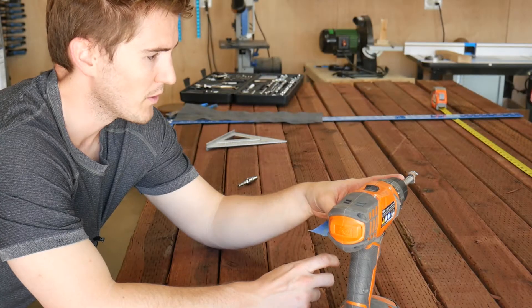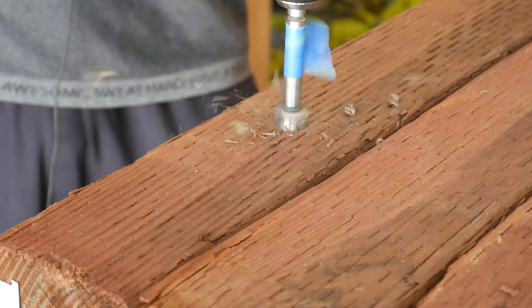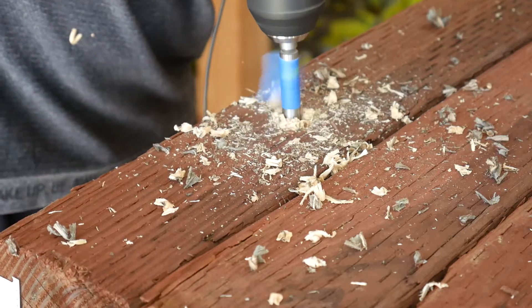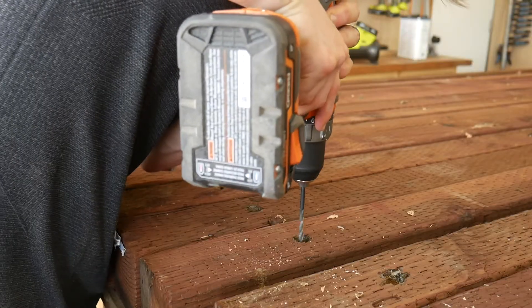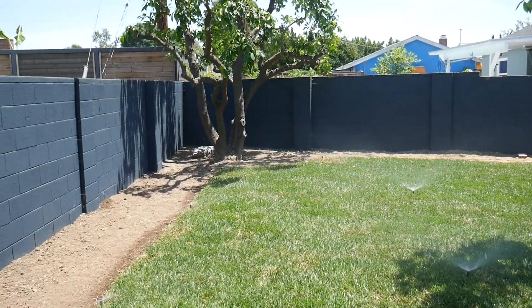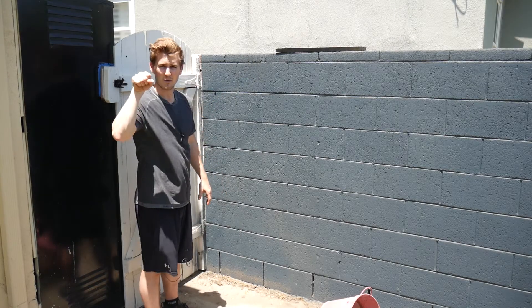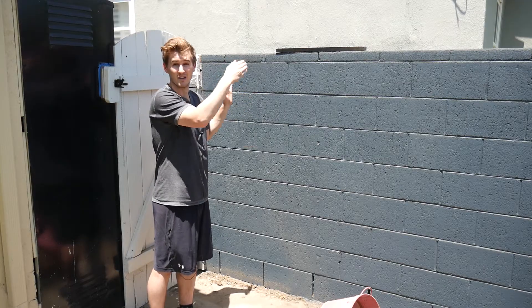I'm going to use some blue tape to mark out how deep I want this drill bit to go — the screws are pretty big so I don't want to overdo it. The way this is going to work is I'm going to start in each corner of my yard and then work my way inwards, starting in the corners that are most visibly exposed. I'll put one post up, use a clamp to hold it in place, drill the holes that accept the screws using the masonry bit, and attach the posts one at a time to make sure the spacing between each lattice is correct.